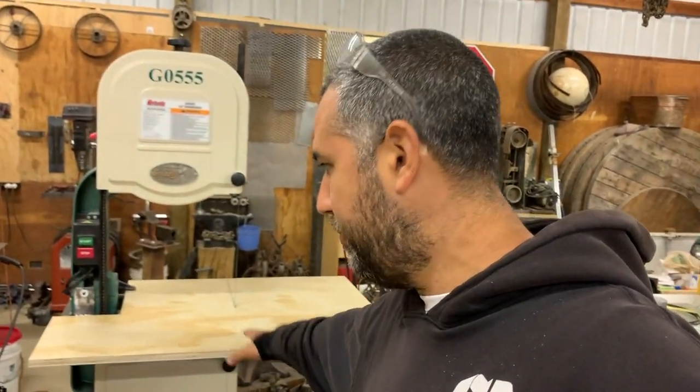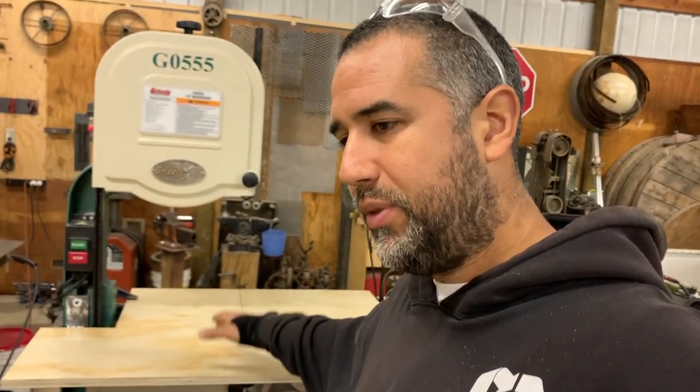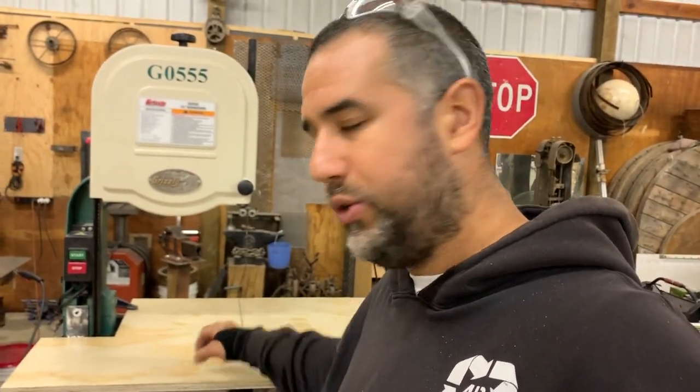Look what I got, a much larger surface area. This is great. This is all attached, everything's rigid. The blade is square to the new tabletop. And now I'm going to resaw some very old, very dry, very hard ash through this new 5/8 3 TPI resaw blade. And we'll see how it does.